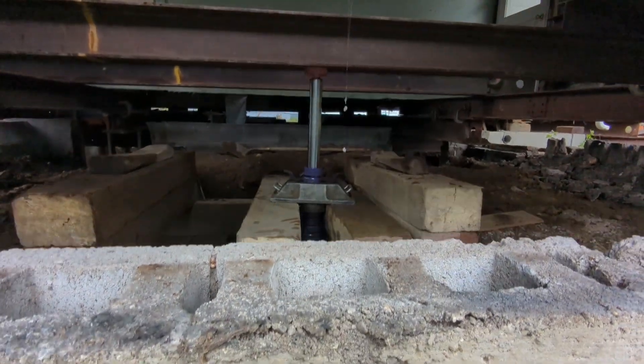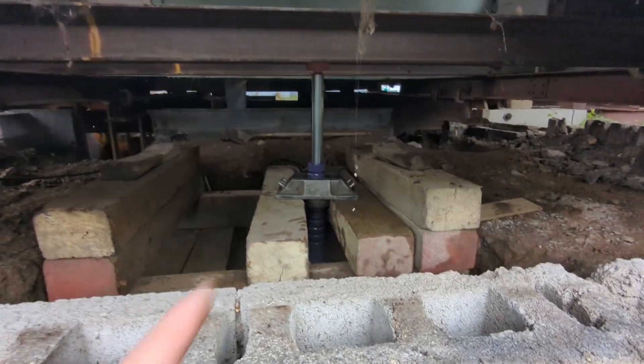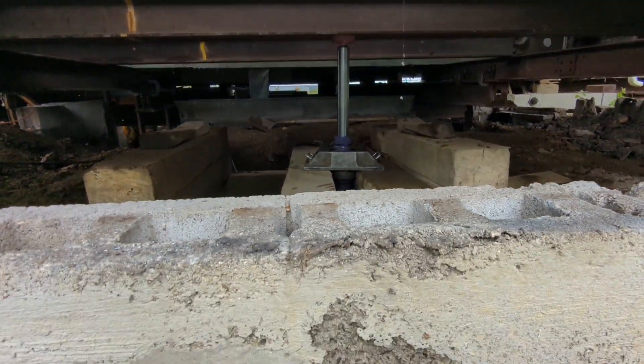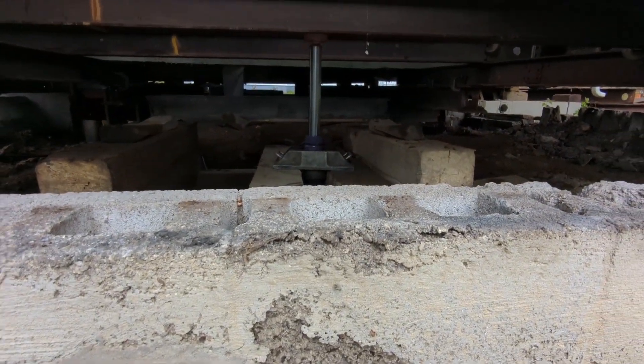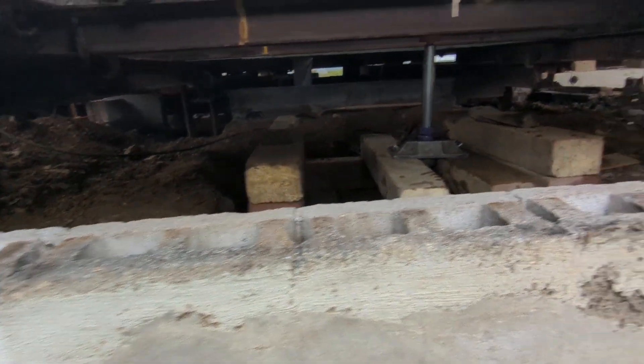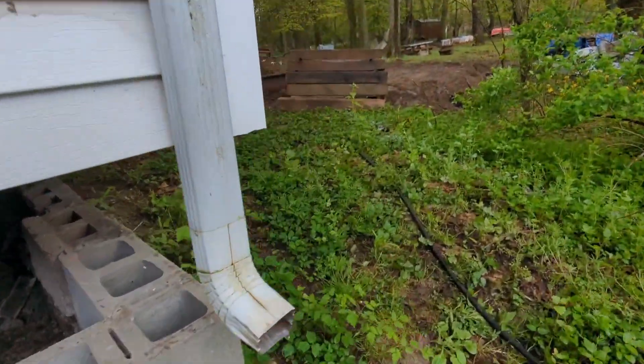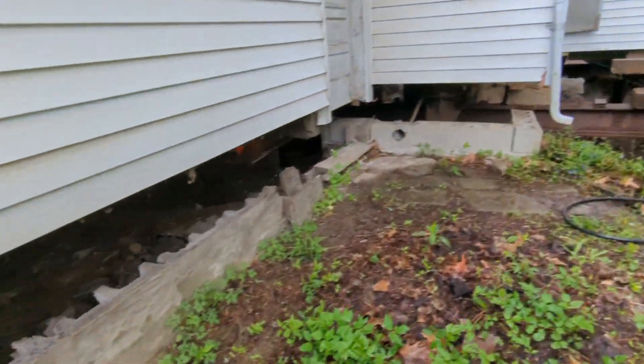There's your power pack hanging on a couple of cribbing blocks to get the stroke, because you need to have the overall lift height you want. You gotta hang down into the ground some with that. Sounds like we're gonna pause and have a little inspection.